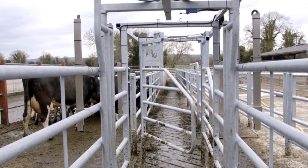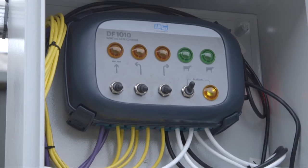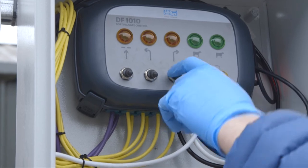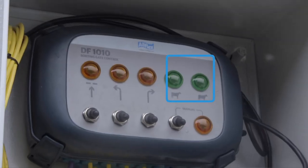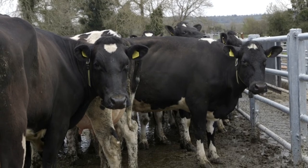From here you can use the gate manually to test the speed and adjust accordingly. You will notice that there are LEDs which light up to indicate that it is either in manual — which will be orange — when each gate is triggered: both separation gates and also the Texas gate, by flicking the manual switch. We can control the left hand gate, our right hand gate, and our Texas gate. You will notice the LED trigger each time a gate is in use. There are two green LEDs to the right of your manual control switches. One of these will flash when an animal is ID'd or a tag is ID'd within the gate, and if that animal is selected to sort, both will flash together. Once this action is complete it's very important to reset your gate and turn off manual, because this will then once again enable the automatic sorting from your SenseHub system.